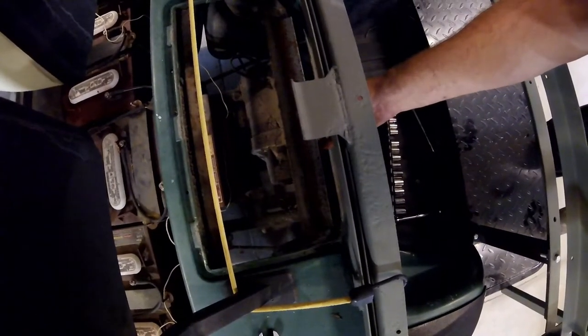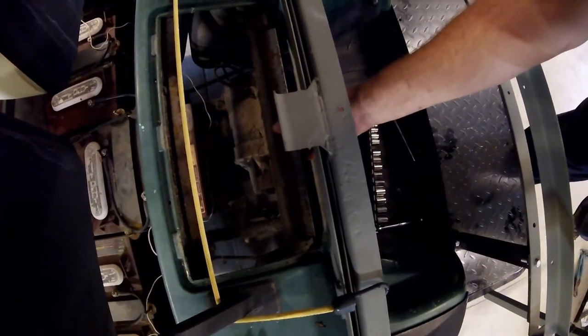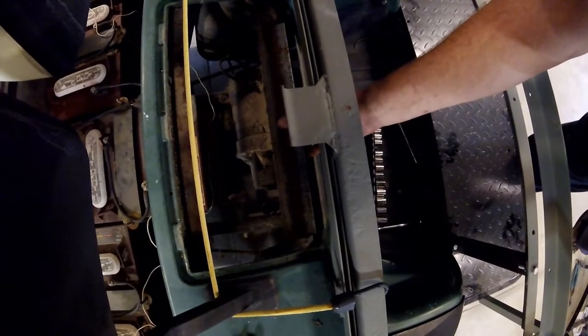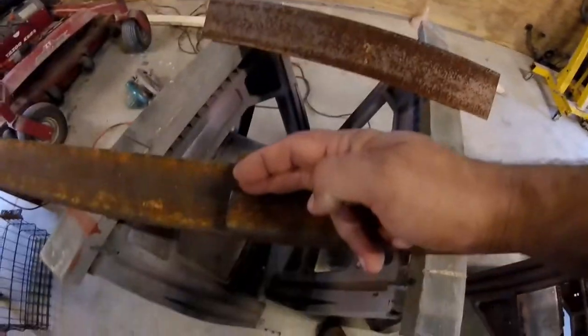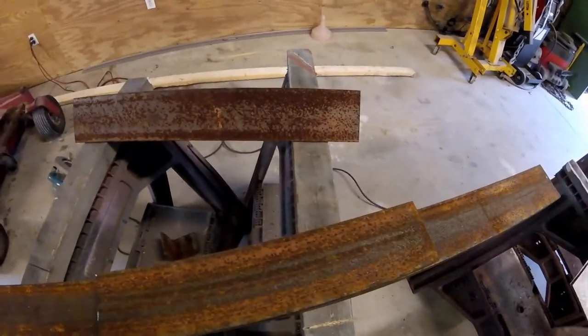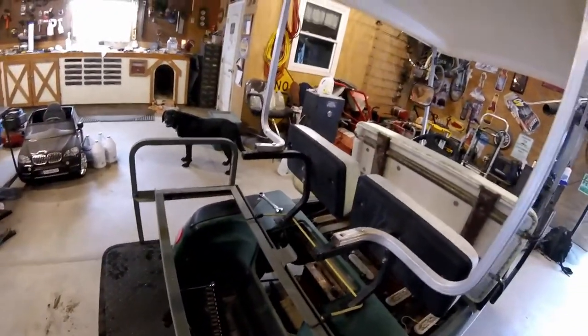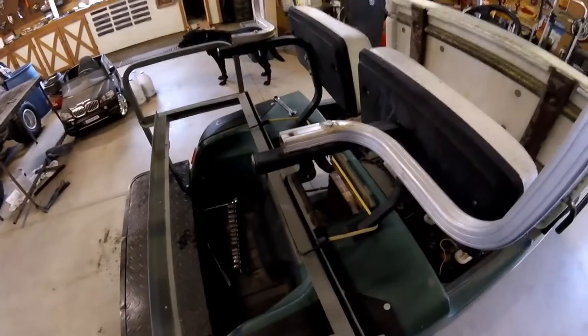Making sure that this is straight up and down, that'll give me a plate to mount from. We'll center that out, weld it just on the top because all the pressure is going to be downward. From there we're going to take this angle — I have a piece cut here, it's three inches wide — cut that and basically make two tabs, one that sticks out here and one that sticks out here, drill a hole in those tabs, then weld some kind of bracket onto the seat itself, very similar to what was on there, attach the seat to that bracket.